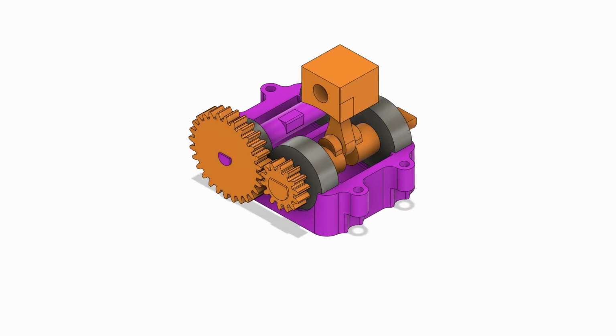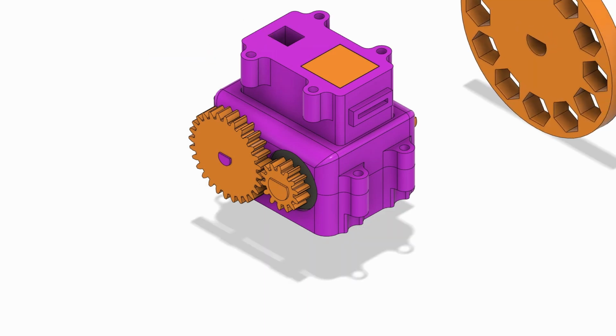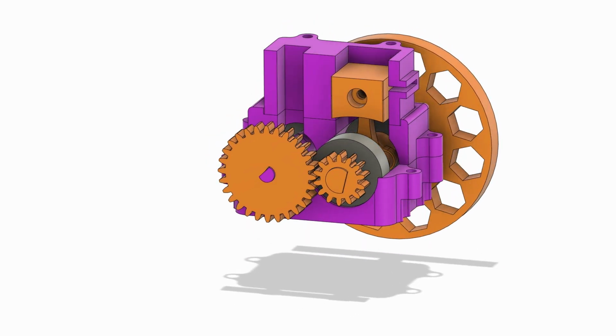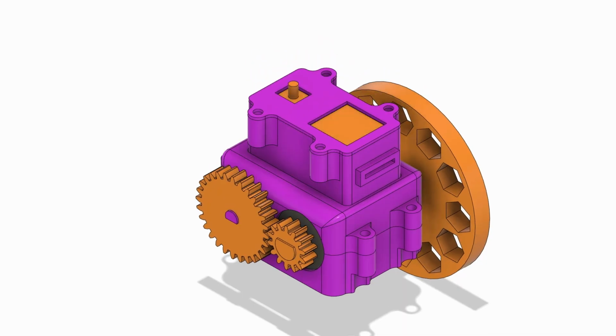After you've pressed the gears onto the respective shafts, then press fit the jug assembly on top, making sure that the piston and push rod almost have no friction without lubricant. Then once your engine is at this point, take the flywheel and attach it as balanced as you can and spin it. If that piston can't do a whole rotation without stopping, keep sanding. You'll love yourself later. Then get out the Ninja Flex head gasket or some other gasket material that's 1mm thick and align it with the jug.